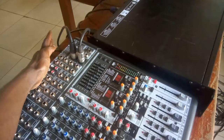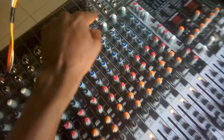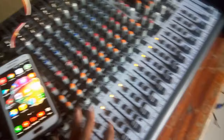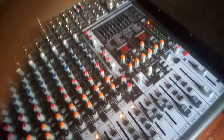I'm going to switch this on, making sure the volumes are at zero. For my source, I'm going to be using channel 16 — you can see here it is a line in. This is where I'm going to connect my phone for audio. My phone is now connected to the mixer as my source of audio, and my mixer is connected to the amp through the main outputs.